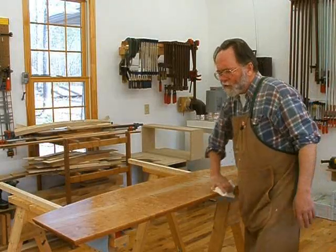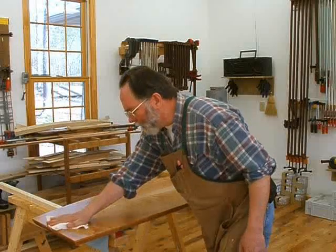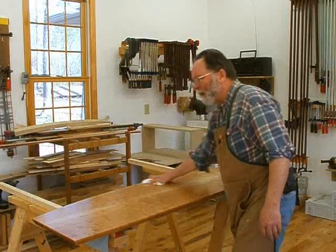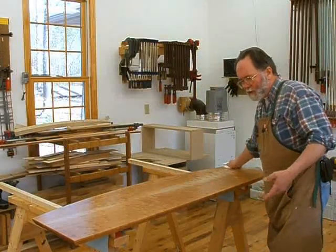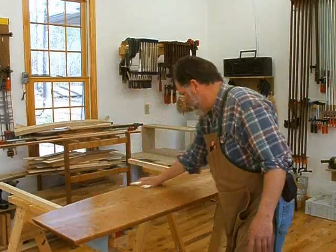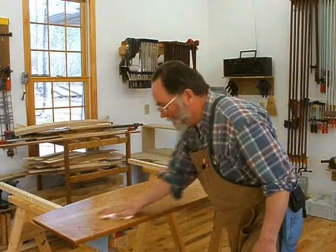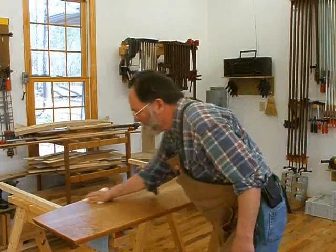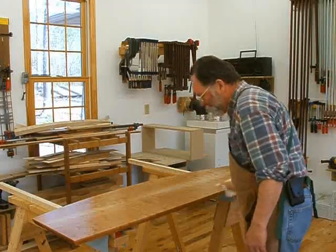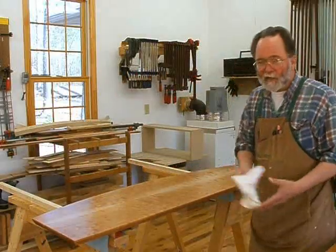The layers I'm putting on are so slight, so thin, there's still enough grain left in the wood unfilled that I found I get good adhesion, and I don't have to go sanding, because of course I've already sanded to P600 and I don't want to rough that up very much. And that seems to work with this process. Alright, and we'll let that cure.